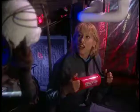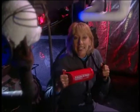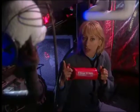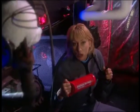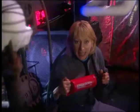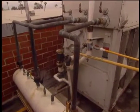This compressor here keeps the chemical moving through the system. It does the work needed to get the heat moving the wrong way. It takes energy from electricity to push the vapor through the condenser. The condenser turns the vapor back into a liquid. And in doing that, the liquid gains kinetic energy. It gets hotter. The liquid in these pipes is now very hot.